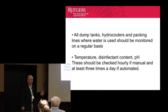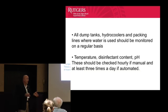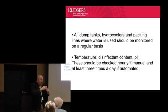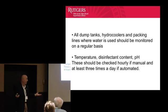It's just that if you're putting additives in, like certain disinfectants, they'll give you a range. If you want this disinfectant to work, the water temperature ideally needs to be in this range, and it needs to be in this pH range. If the pH is too high or too low, the disinfectant might be bound up in some other chemical form and it won't be working for you.